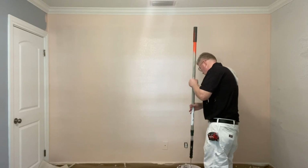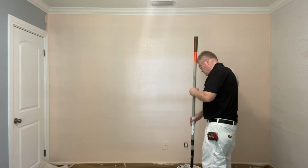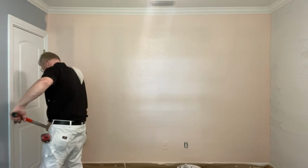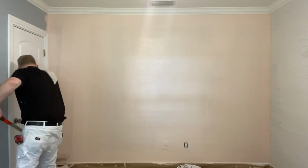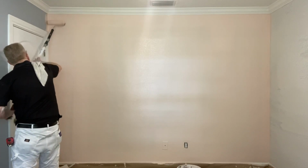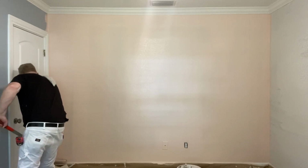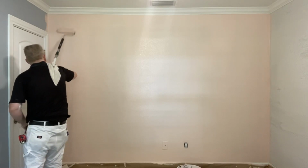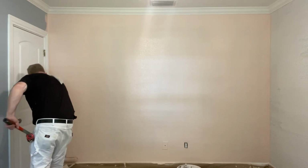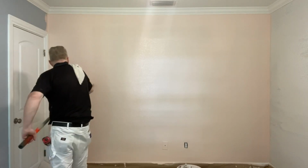So we begin our second coat. And as we saw with the smaller applicators, that is the smaller roller and the brush, the second coat goes quicker because you've already covered the initial paint with brand new paint. And so what I'm doing is just carefully going next to that white door and its frame. If you roll too quickly, you'll have paint splatter all over that door. So you move not as quickly as you would the rest of the door.